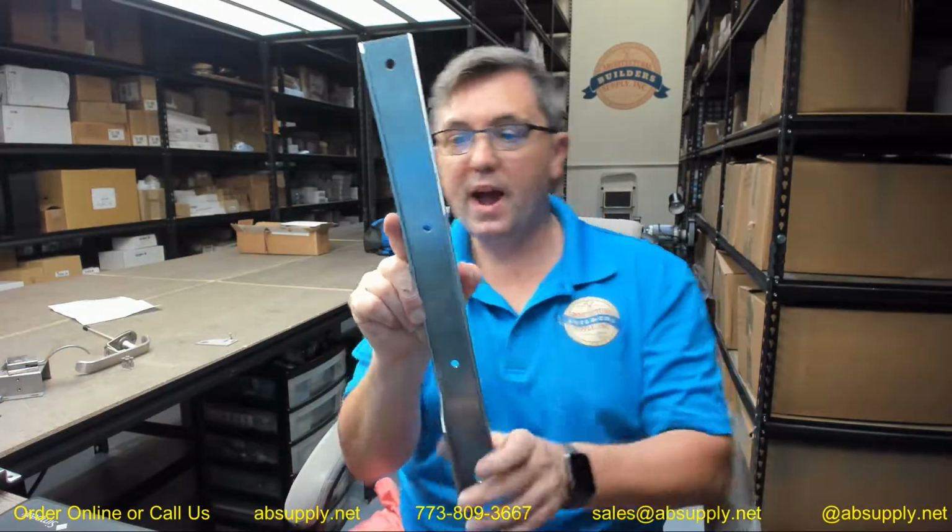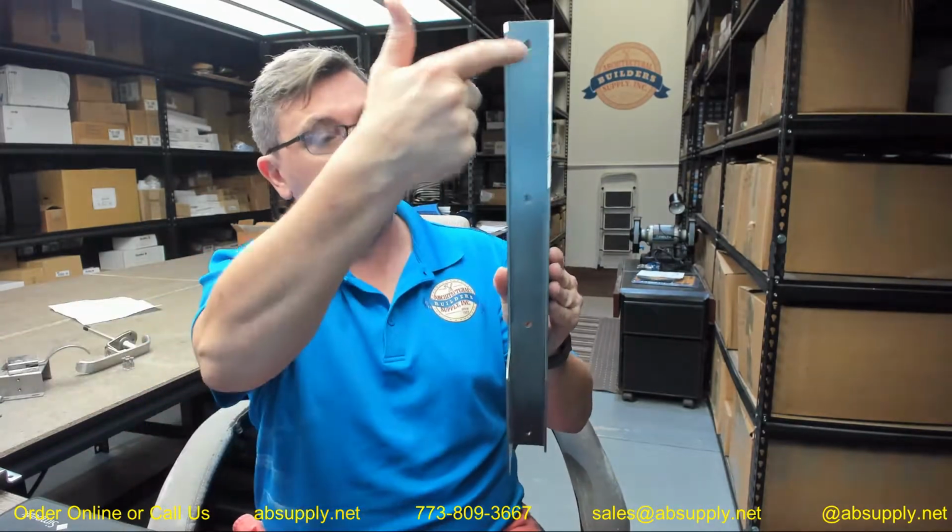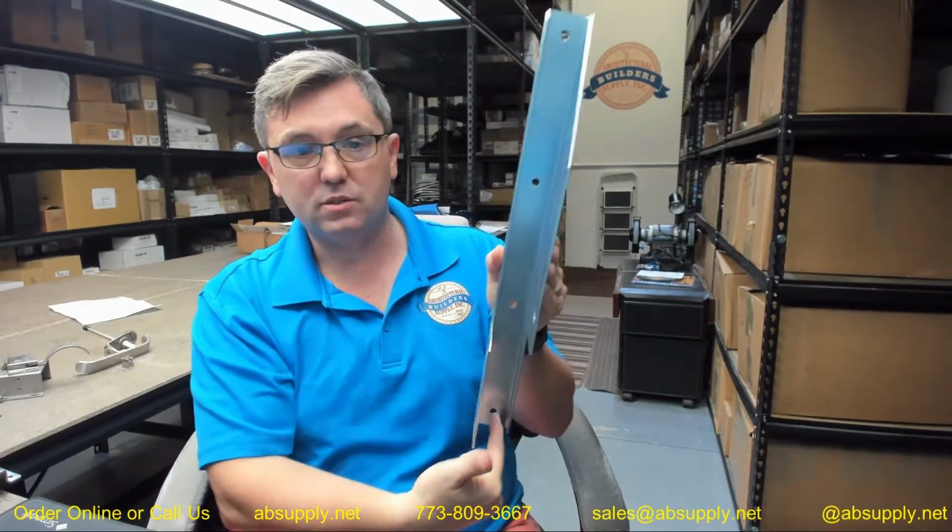So this is the bracket that mounts to the underside of the lid. This will attach in its four mounting points with these. There are four panhead machine bolts. They might be 5/16 with what is called a rivet nut. That's going to allow you to install this down onto your item and give you the ability to squeeze down over the material thickness. And there's four of those.